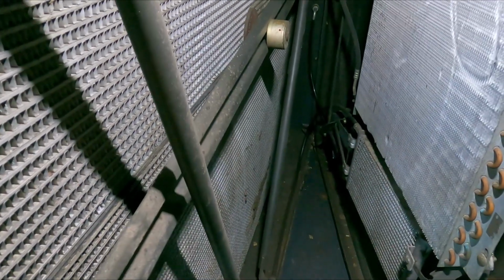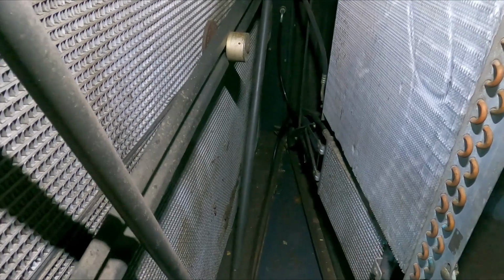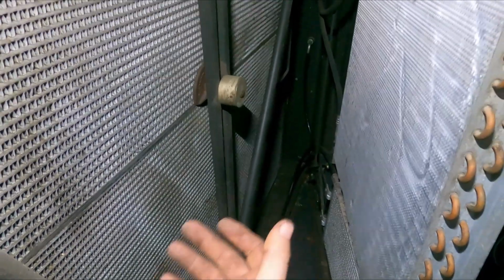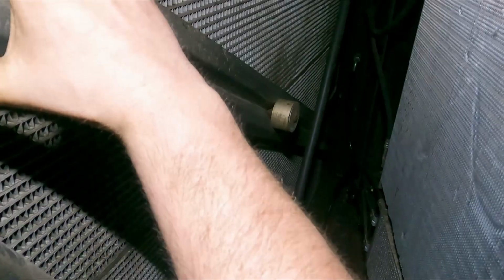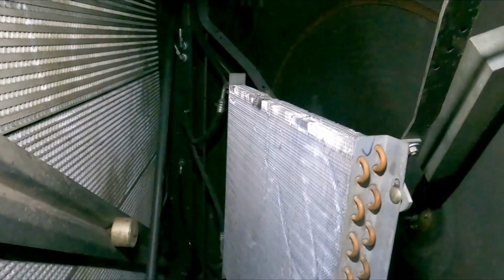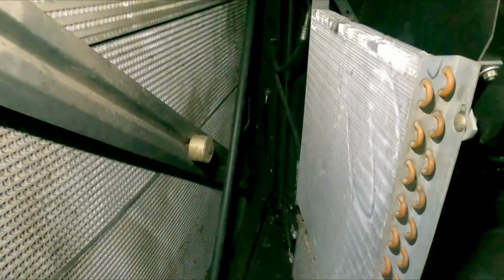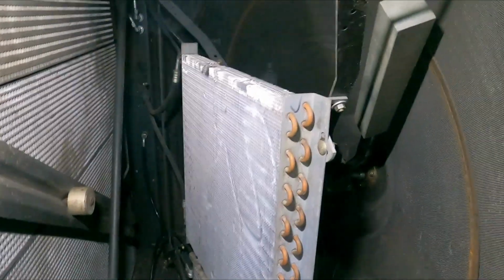Now that seems to have a little bit too much play for my liking, so we will change the bearing on that. The problem is this travels around, and what it does is it stops the flow of air through the cooler, so that the vacuum here has a chance at sucking the dirt and maize and grass and whatever off. Yeah, we're back to sucking off. I know. But otherwise, the vacuum would constantly be fighting against the radiator fan, that big thing here, and that fan literally moves so much air that you've got no chance.